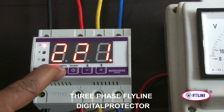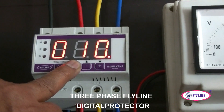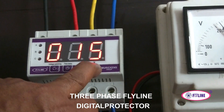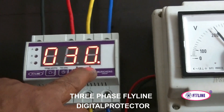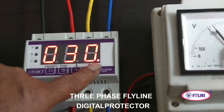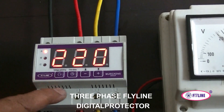Press and hold for 10 seconds and the decimal point will start blinking. Now if you press the plus button, the value is increasing — it has now been increased to 30 seconds. After that, if you keep it idle, it will set and the normal voltage will be displayed again — you can see phase one, phase two, and phase three voltages.